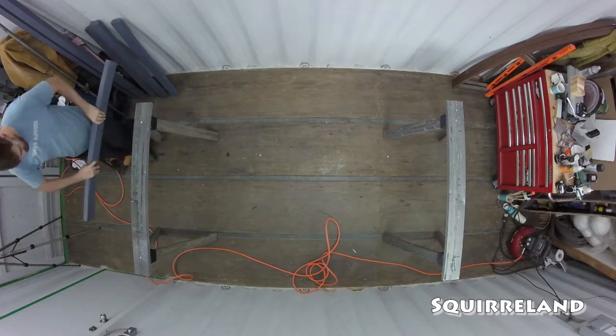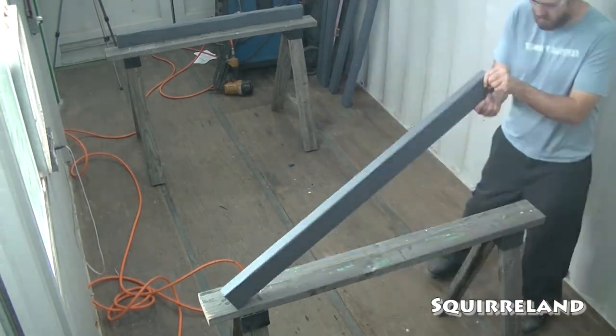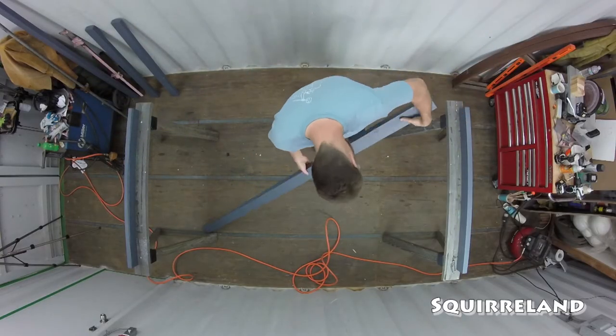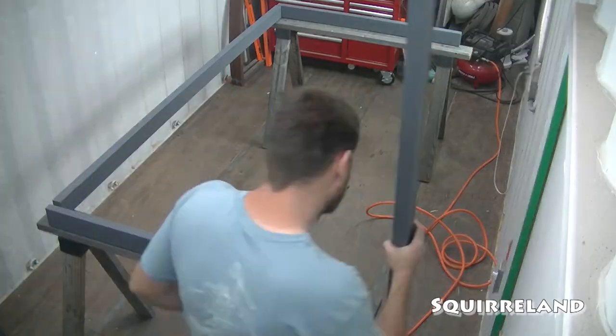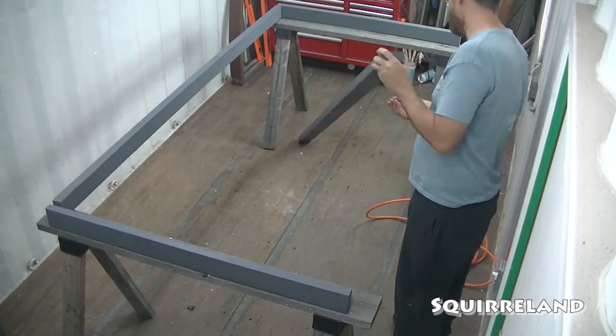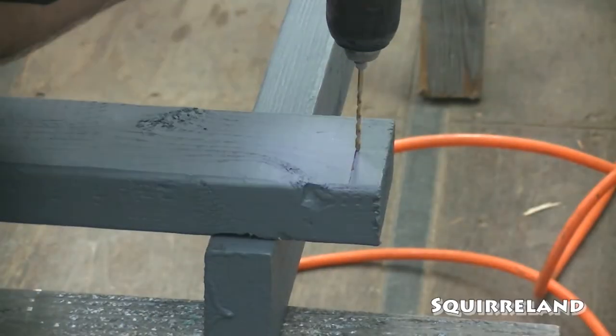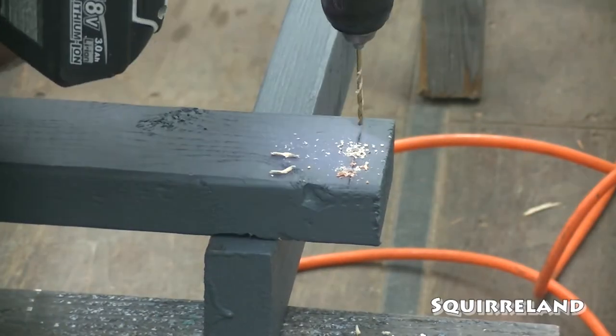The first board that I place is the 48-inch board with the bevel. I place it with the bevel facing up and towards the other 2x4s. Next, I check the boards for any curve, and place them so that the curve will bulge out past the edge of the plywood. I found that it's easier to clamp the boards and push them into the correct size that matches the plywood, instead of trying to pull them outwards towards the edge to line up.